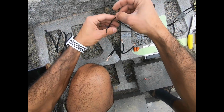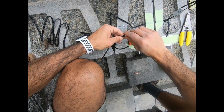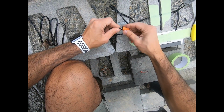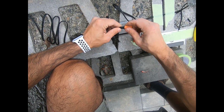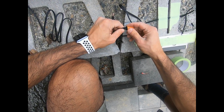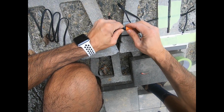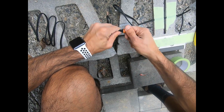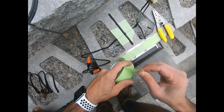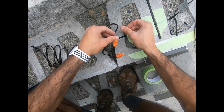And all you're doing at this point is wiring everything together. And it doesn't matter which one goes to where. The trick with these connectors too is you have to start by rotating and then getting them in. And just when you think it's tight, it's not. You have to make sure that the wax starts to ooze out of it right there. That's how you know now it's super tight. And I'm placing this tape here just temporarily until we start putting the steps on top of these treads.